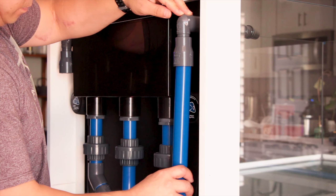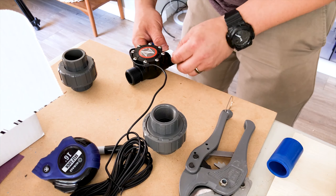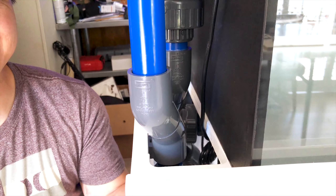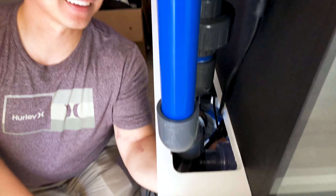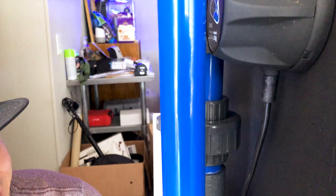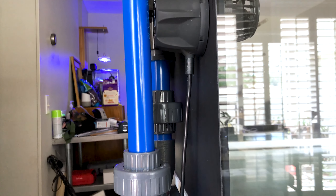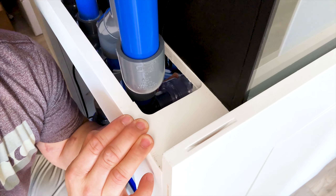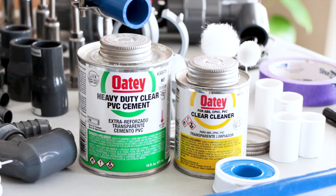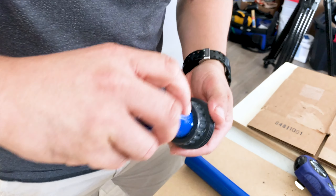On my second and third days I focused on the return lines and plumbing my Eclair-C UV sterilizer and flow sensors. The space is really tight — the manufacturer originally provided soft tubing for my returns, but with accurate measuring and utilizing 45-degree elbows I was able to make hard plumbing fit. There are several areas where fittings were paper-thin tight next to things, which was one of the most challenging aspects. I also used primer and cement, and I sandpapered the edges of my pipes after cutting — a process called chamfering, which helps the pipe fit easier into fittings when you glue them.